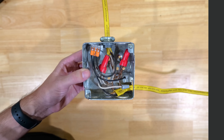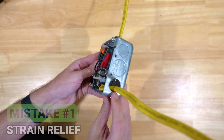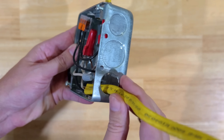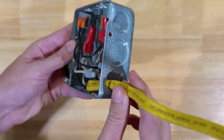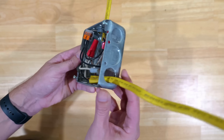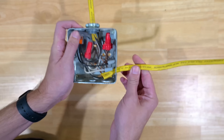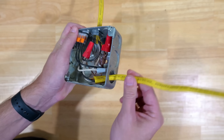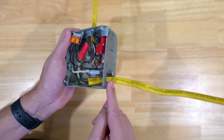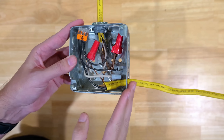For this first mistake — probably one that many of you notice — if we flip the box over to the side you'll see this cable going into the box through this hole, and we do not have anything holding this wire in place. Up at the top we do have a proper clamp and some strain relief, but over here on the side we have none of that. This cable is free to be moved around, it can get cut on the metal, it can be pulled on, and instead of the strain relief being here, a lot of it is on our connections, which is never a good thing.